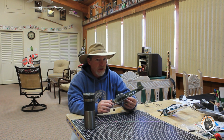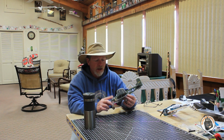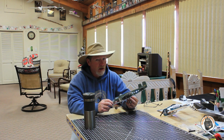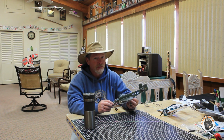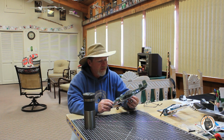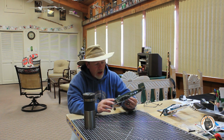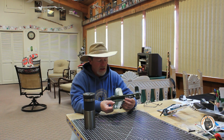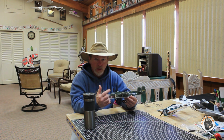First I'll test the motors on the thrust stand. If it looks like two 8520s are going to give me the amount of thrust I would like to have with the props that I have on here now, then I'll be in business. If not, then I'll look at 1020 motors. I'm sure that the 1020 motors will give me enough power to do aerobatics with this plane. And I'm hoping that with the heavier motors forward of the CG, that will enable me to not have to put my battery so far forward to get the CG where it needs to be.